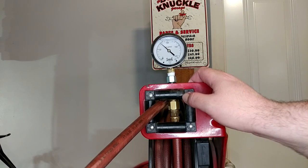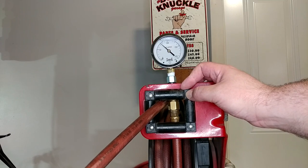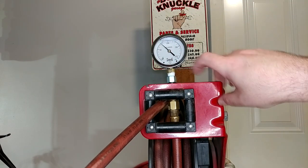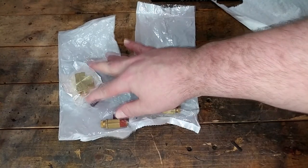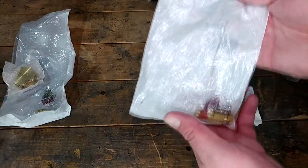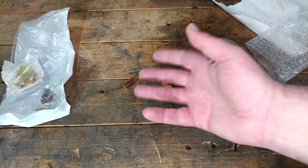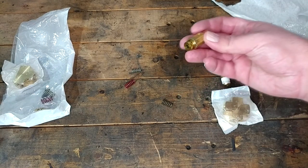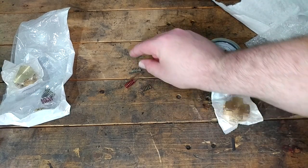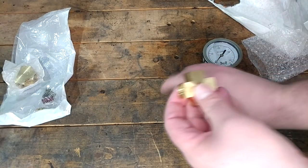I bought all the stuff so I'm not going to worry about putting the blow-off on the tank, because I'll just be taking it right back off whenever I scrap the compressor. But I will put one over here on the hose reel along with this gauge, so we don't have these kinds of questions in the future. It'll be in my long-term plan to have multiple air gauges in my air system so that if something like this happens again, I'll know what's up more immediately. I'm not going to be able to set this pop-off valve because I don't have enough air pressure to test it. My long-term plan was to take this somewhere that has like 200 psi of shop air and adjust it down to like 130, 135 — a little bit more than my compressor would actually make. But that's not in the cards today. So I'm going to just leave it however it came and hold on to these other springs. There are no instructions that tell me which spring is heavier or lighter, so I think it's just a feel kind of thing — I don't think you stack them, I think you just do one at a time.